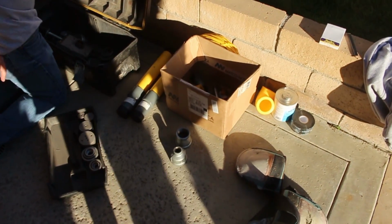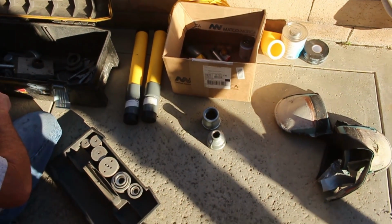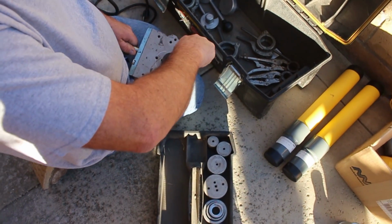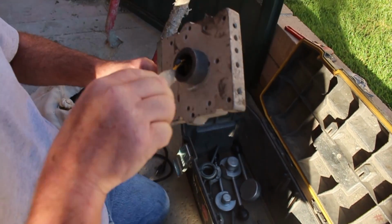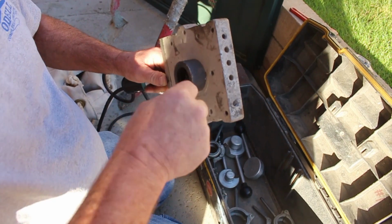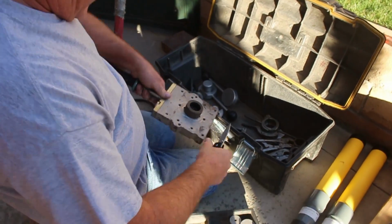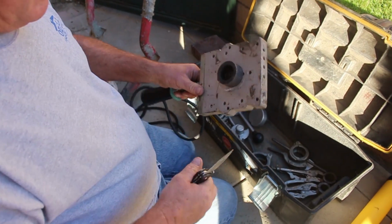Now here's the tool I was telling you about, and here's the transition fittings too that go to steel, because you need steel 6 inches above top of concrete. You can't have the plastic going above the concrete, because if someone were to hit that with something and cut the plastic with a who knows what edge or a mower, you could have a real big problem. So you want steel above grade. So that's why they have that steel nipple there and that transition fitting there.